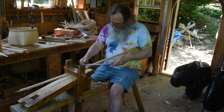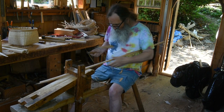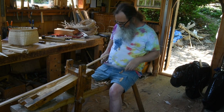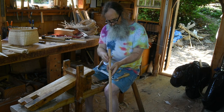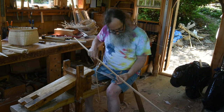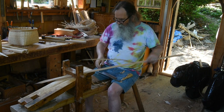You can see the grain distinction in the hickory, but it isn't as blatantly obvious as it was in that ash fillet I did in the basket making video when I was shaving them for pounding. That is closer to being right. Now it's a matter of dressing the thickness. This isn't thick enough to split in two because of that area right there — if it were all that thickness I'd split it in half and get two. So I'll just bring it down roughly to size, and then I'll mark it.